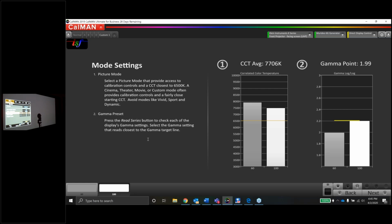Does that software cover all models from these 2016s and 17s all the way through the new ones? Yes, the software has been around since the very beginning. What you have to do is go to the JVC webpage, go to any model number under support, where the firmware is. You'll see it say JVC calibration software for models XXXXX. So for the model you're using right now, the RS600, it'll say it's for the RS600, 400, 500, and then the X versions. I don't remember what they are off the top of my head. It applies to everything in that model year.